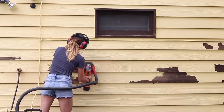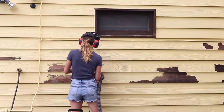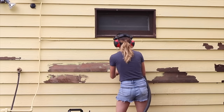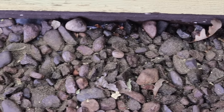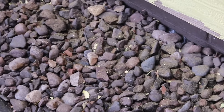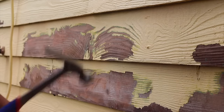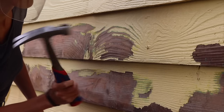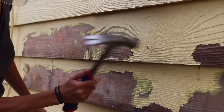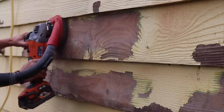After a while I did recognize some pitfalls of this method. The first is that you really have to keep this brush moving — it is very abrasive. It cuts the paint off and it also sands into the wood, and if you tip it too far to one side it gouges so fast. The second is that it leaves little fine debris everywhere. I knew on this house I was not dealing with lead paint, but this is absolutely not an effective way to remove paint if you have lead in it — the fine debris makes it nearly impossible to protect your lungs. Before running the diamond brush over your siding, you want to check for nails that are sticking out and hammer them in. The diamond brushes are kind of expensive at 50 or even 60 dollars per attachment, and they do probably 200 to 400 square feet depending on how you're using it.